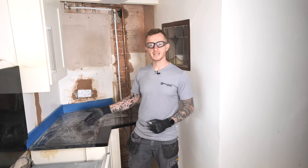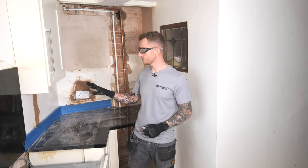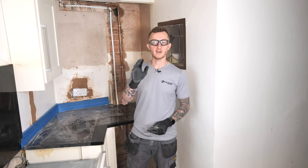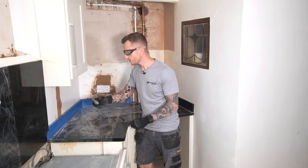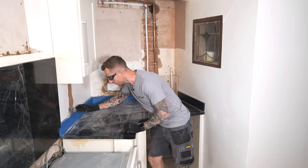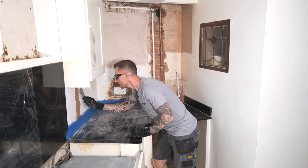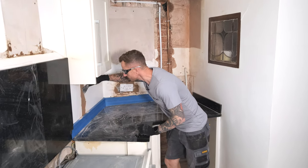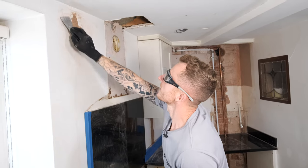My Bonding 60 has had around 75 minutes now — probably a little bit longer — just to make sure it has gone off nice and hard and is now ready to receive our finish. Before we get our finish mixed up, I'm going to run over my chasers with a scraper and give the edges a light scrape just to make sure any excess bits are gone because we don't want these interfering with our finish. Just a light scrape — nothing too serious — just make sure there are no high spots anywhere, and that will make your job a lot easier when you come to finish.